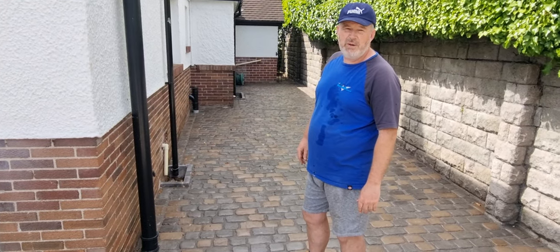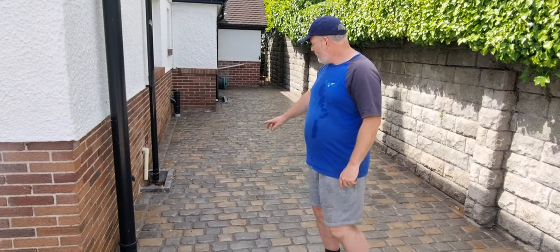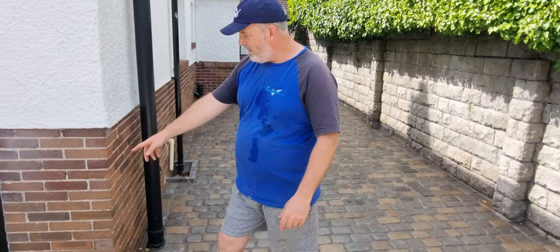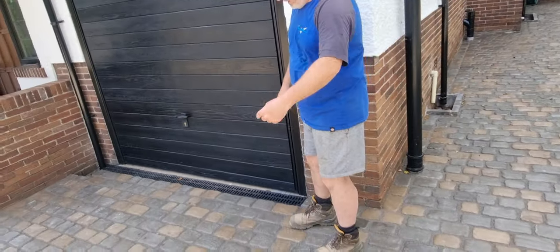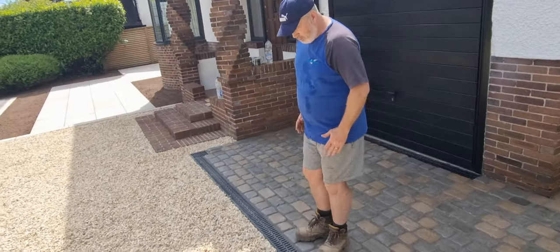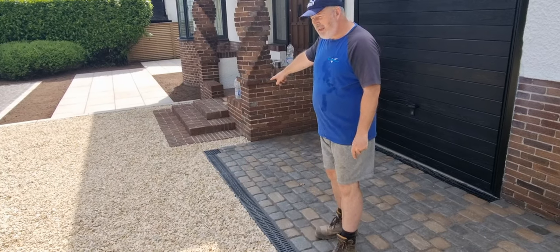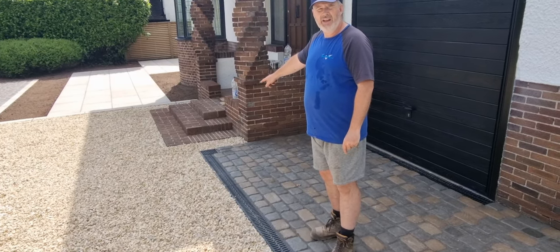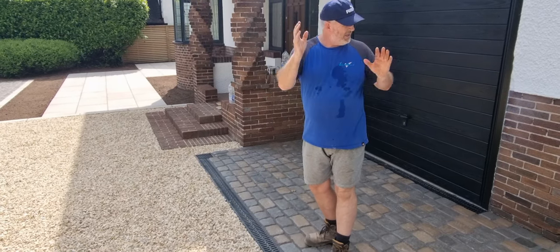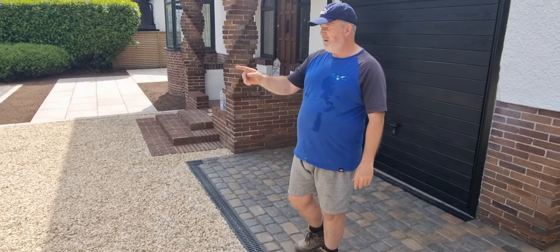And you had the patience to do it, not me. Yeah. And that was a really, really good setup. So no cuts apart from around the manhole. So that's that Drivesys system. We put drainage in here just as a backup in case the wind wants to blow rain into the garage. And then we could have let all the water go out onto this one, but we incorporated the drainage system, connected into the main drain with a back inlet gully, so there was water in it to not allow any smells to come out. So that's the second Drivesys paving system,